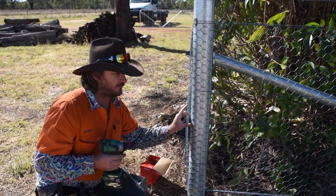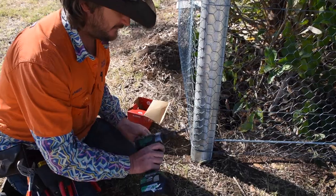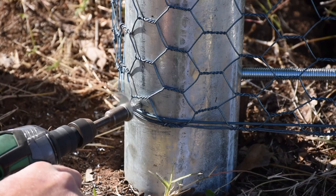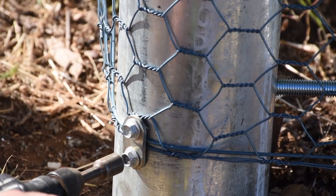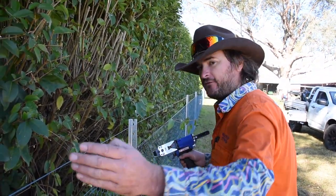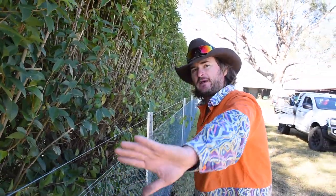What we're doing now is we're just going to screw the corner off. Glenn's down there clipping and we're going to put our two hole plates on here so the wire can't travel up or down or slip around the post. We find the peak of the post to the point where it's right angles. You know it's tight when the plate has got a bend in it. There's a million different processes and ways you could do this but the general principle is you've got to get the top neat. So we're going to go forward, clip back along the top and along the bottom. The single most important thing is getting your top right so you don't have a belly in the netting.